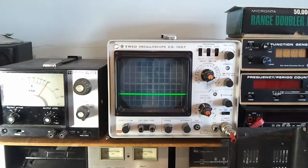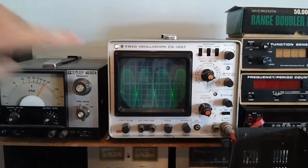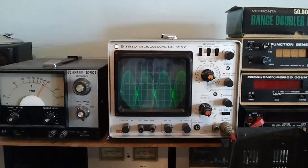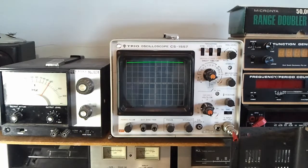So there's our sixty volts bias. We turn up the input signal — it's getting bigger and bigger. See how it's clipping here? Rather badly too. Let's say there — that's one and a half divisions down. We're on ten volts per division, so one and a half divisions down is fifteen volts. That means the input signal is not reaching zero volts on the grid, therefore not driving those grids into grid current, therefore not developing ALC. So the distortion is being caused by something well before the ALC is normally developed, and is being fed by the driver stage in that distorted way.